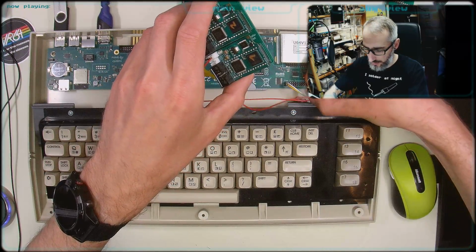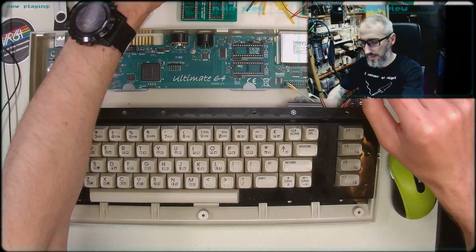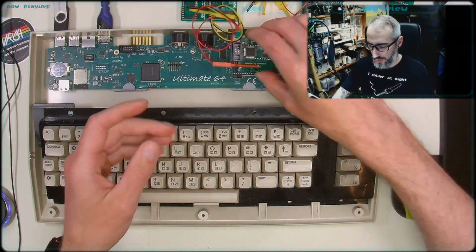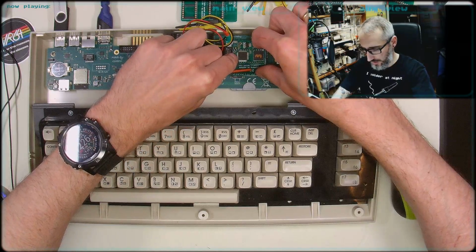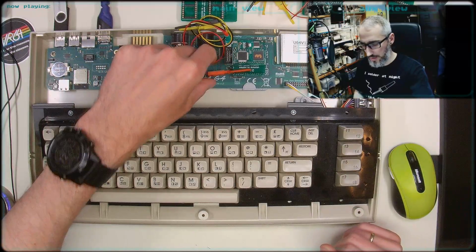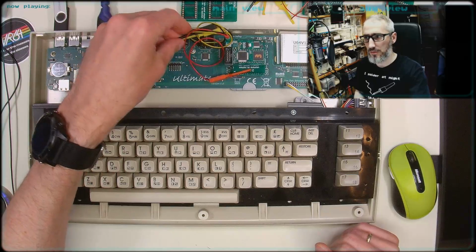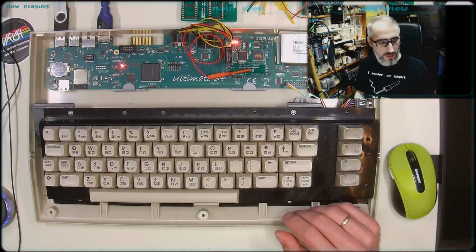And those red wires. And let's put this aside. And now we install the one FPGASID adapter. Pay attention that we really hit the right sockets. The red wire is already connected to chip select. Black and yellow is not required. And if we're going to start a system, we should come up with a picture.